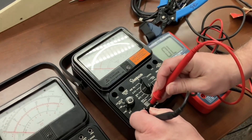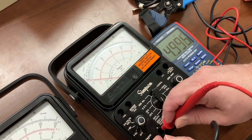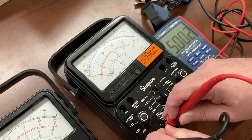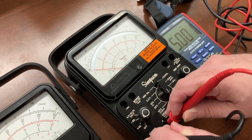Measuring that, I measure a 5 megaohm input impedance. I think most of these probes expect something like a 10 meg input impedance, but this should be close enough to get something in the ballpark.